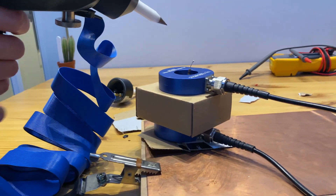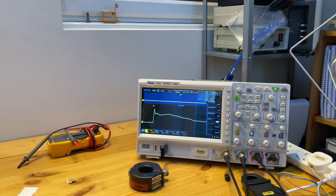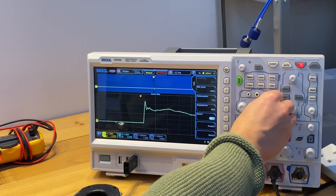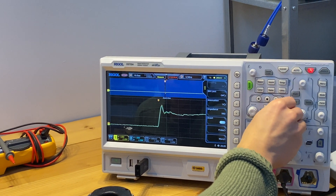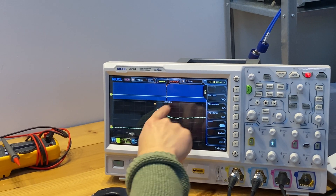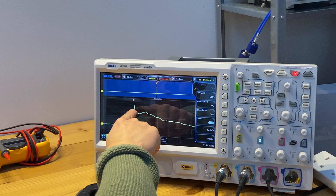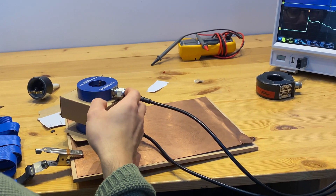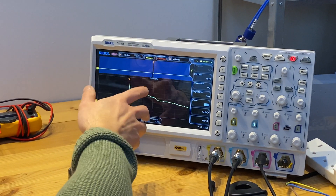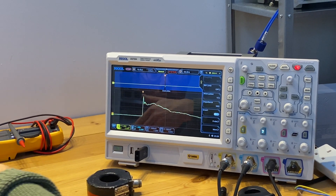In this case, we are going to inject some ESD current into this resistor. As we can see from the result — let's stop it. If I put this in the center, you can see it's not 100% closely matched, but rather than tiny phase shifts and some small differences, the majority of the waveform are almost the same. This little difference might be caused by the setup — if I swap this one and put the other on the back and see if the color changes, it might be due to the delay on the current path. But overall, this shows that these two current probes are matched quite well.